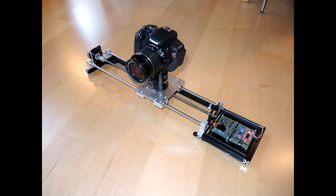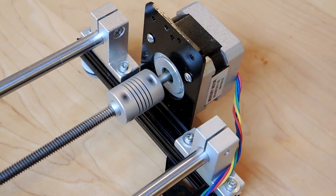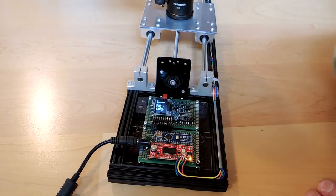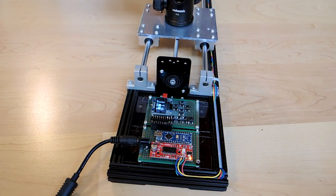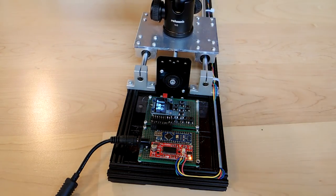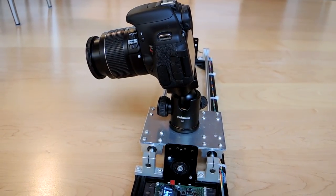There are definitely some things I'd like to change now that I've gone through the whole build. The lead screw is a relatively slow way of driving the platform — the Arduino does bit-banging onto the motor driver and you can't get much past a few inches per second, which may not be fast enough for some videos. So a lead screw might not be the right approach for high-speed shots. However, for time-lapse photography the lead screw works extremely well — I can program the rig way down in speed and have it crawl along over a multi-hour exposure. Anyway, this has just been my build log of my approach to this camera slider — hopefully of interest.